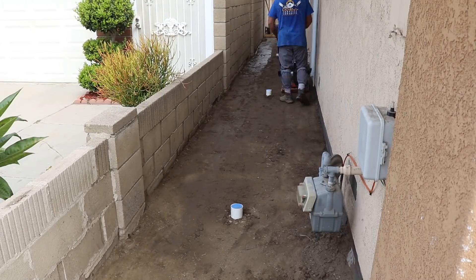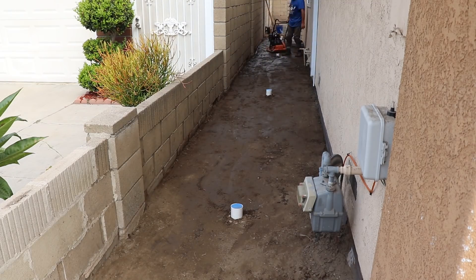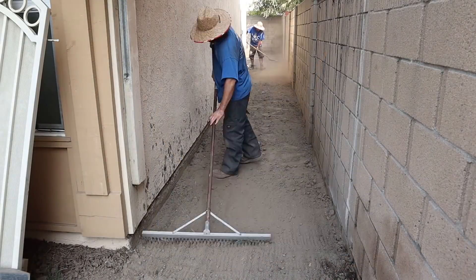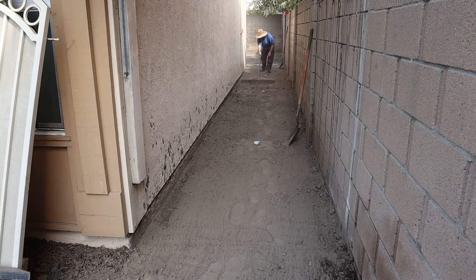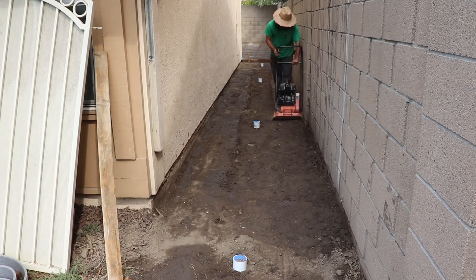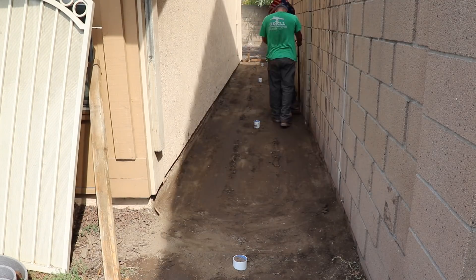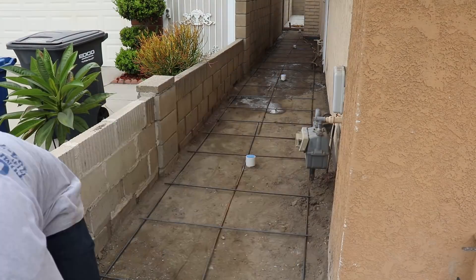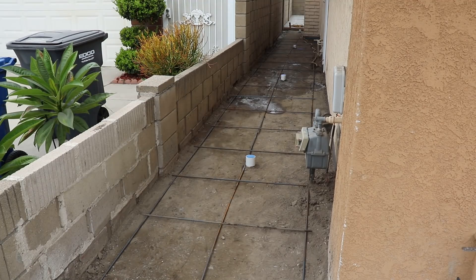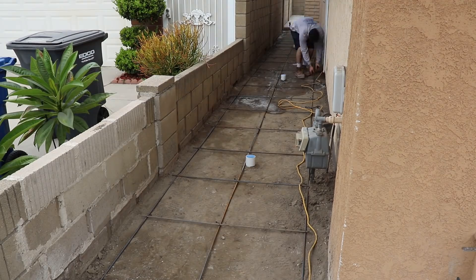I didn't like how the previous concrete was removed without expansion felt, so I'm putting it in this time so someone won't have to punch holes through the wall getting it out again. It also gives the sidewalk space to shift without cracking. The way I laid out these drains was really effortless — I used the columns on the block wall, which are about 12 to 15 feet apart, and just set my drain at each one. That also lines up with my crack control joints off each column, so I didn't even need a measuring tape.